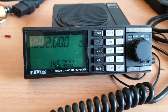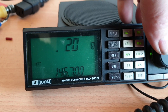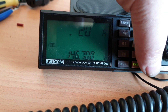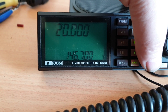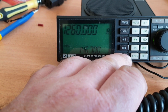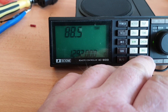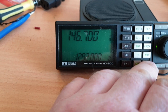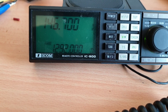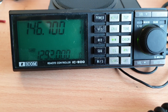Look, great little unit, and a little bit old school in a couple of ways they do things. Basically when you go through the set range here you're setting your increments. I've actually gone into set mode on the 1.2 — let me get out of this. AB 600 split, tone 88.5, band edges, back to memory. So it's not overly hugely impressive, but these were just something that people — especially the 1.2 and 430 meg people — had a bit of fun with. We'll probably keep one of them, not three. It's not really going to be needed.